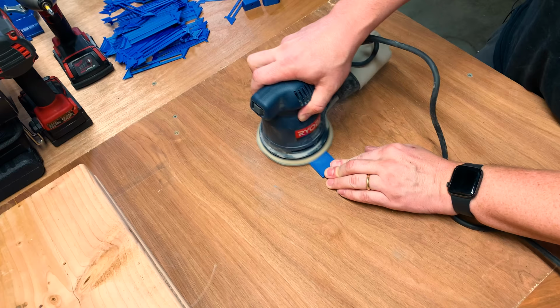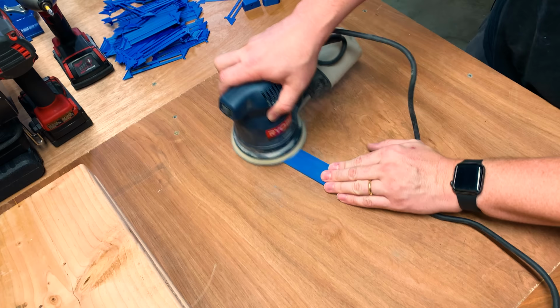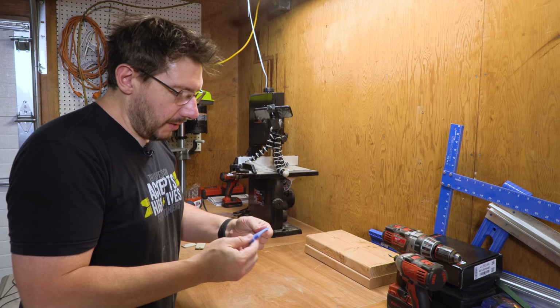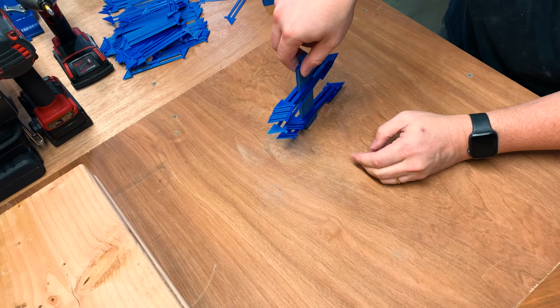Jeez. Just a sec. With PLA materials, or plastics in general, but PLA especially, you do have to worry about the temperature of the material when you're sanding. Friction's gonna cause it to heat up, and then instead of sanding the material, you're gonna be pushing it around and smudging it around, so that's no good. But right now, this is super smooth. Super duper smooth. We should get better sliding.